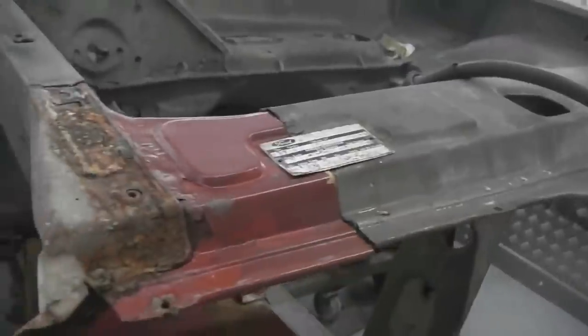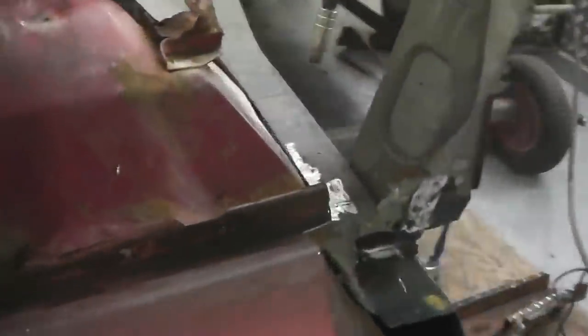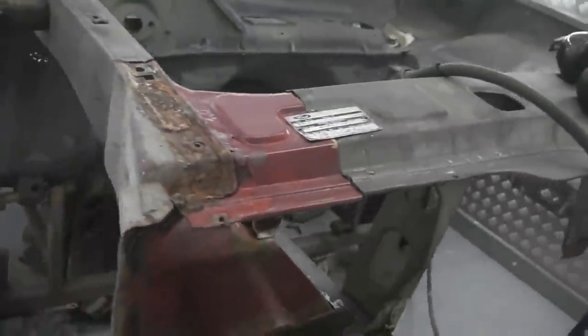Check in with the VIN plate, that gives us an idea of spacing as well, because the VIN plate rivets have to land in the right place. And there's our cut, looking quite parallel just initially as I'm watching this playback. So round we go to have a look at the other areas where it all fits together. I'm just lining that little tag up with the tag on the front of the C-section, making sure that the apron's really got the correct position, which it looks like it has. Again, there's the VIN tag, just showing that we can get the rivet spacing right, so all the relative positions are right. It's a handy little tip where I cut it, bridging it across with the VIN tag.